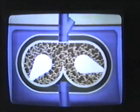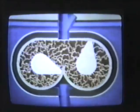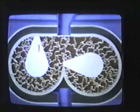Chemical curatives will be added in a second mixing stage as the master batch is used. Both mixing stages take place in a three-story machine called a Banbury mixer, whose steel rotors are driven by a 4,000 horsepower motor to break down and blend the nervy bales of rubber with the other materials in the specified formulation. Some 10 different compounds are required for the various components in a tire, each developed for its own unique combination of flexibility, toughness, and durability.